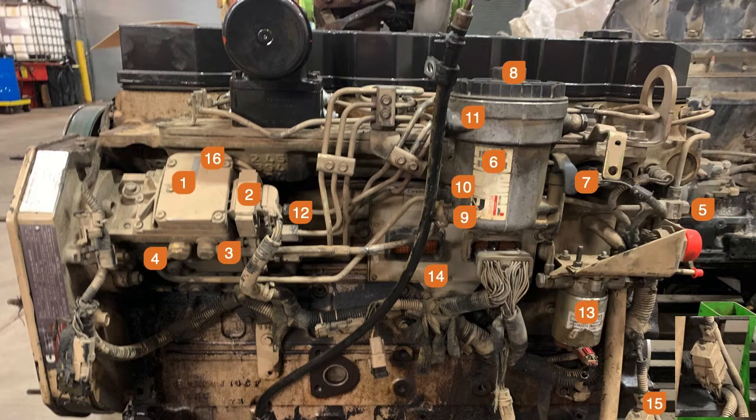So that's the fuel system on here in a nutshell. Again, it'll go to 275 horsepower, it idles nice. You'll notice this ECM has two ports on it. The port right above number 14 has no plug — that would be the OEM port. The port on the back that's got the harness unplugged is the engine port. Typically on a Dodge pickup that had this fuel system, the ECM would have one plug because they made it more non-commercial friendly.